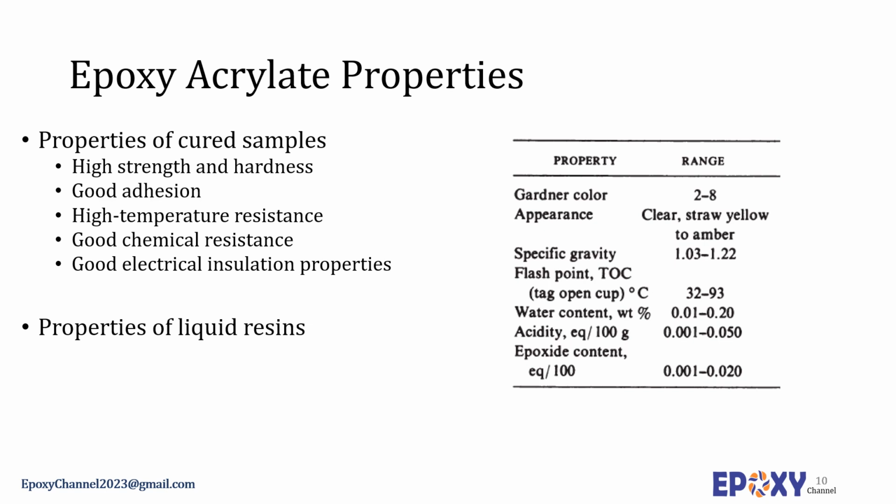To reduce shrinkage and obtain maximum strain, adhesive formulations are based on vinyl ester resins with low backbone, double bond content, low co-reactant level, and high filler contents. The addition of various rubber compounds to reduce shrinkage also improves the peel strength of vinyl ester adhesives.